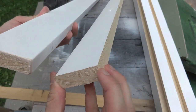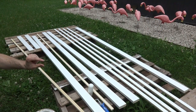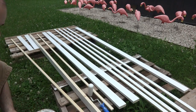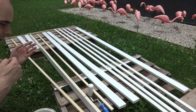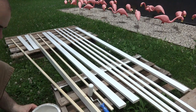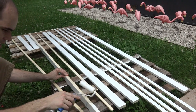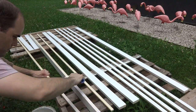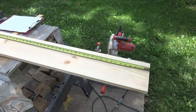I just need a slightly more rounded profile on the cut edges - a little smoother so it looks better once painted. I got all the pieces sanded and even cut the little tiny bump-out trim pieces for the door cheat. Now I'm going over all the raw sides with oil-based primer, which will probably take two coats. It's pretty warm out today so I think it'll dry quickly, then I have to put on some gloss white paint. While that dries I'll keep cutting on the table saw. Now I'm starting on the window trim.